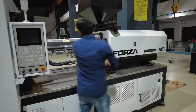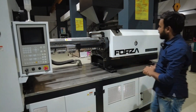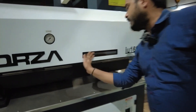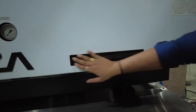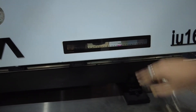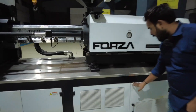Here you can see there is a hydraulic movement for the injection unit forward and backward. This linear actuator helps to move the injection unit in the forward and backward direction. Here you can also see a charging scale, which shows how much material you have charged and how much your screw is coming back during charging or refilling.